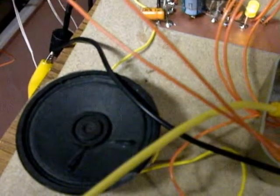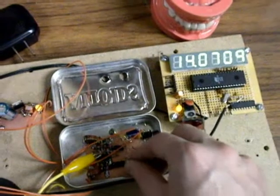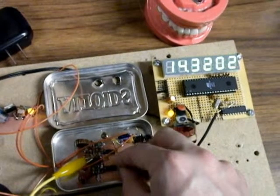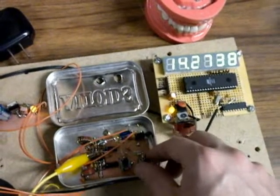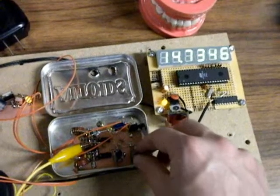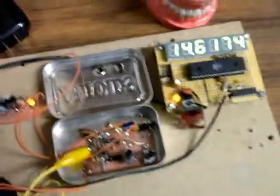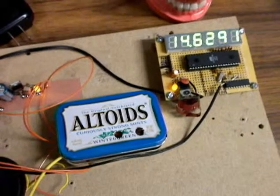Let's see if we can get to the edge of 14 MHz. I'm having a little bit of trouble because this screwdriver doesn't really fit that well. Now we're at the edge of 14 MHz, and I bet these knobs can help me take it just below. Now I go from 14.0 to about 14.3 — pretty much the whole band. I can use the fine tuning to take it up even more. It's not very stable with the lid open, but I can't close it all the way. We definitely have something to work with here.